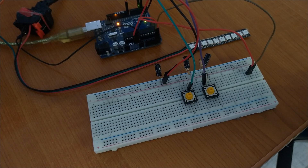I've done four sketches. The first one with only the buttons. The second one with the buttons and a small OLED display with a resolution of 128 by 32 pixels with SSD1306 chipset. The third one, I replaced the two buttons with a rotary encoder with a built-in switch. And the fourth one with a rotary encoder and the small OLED display. It's practically a menu with four options: going forward with the selection, going backwards, applying the new selected function, and a fast way to reset the running function. Let's see the first sketch in action and then go through the code.